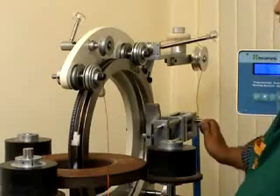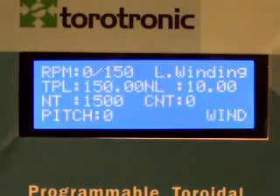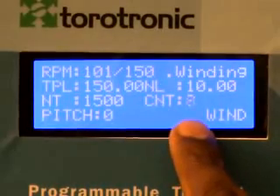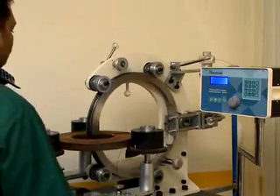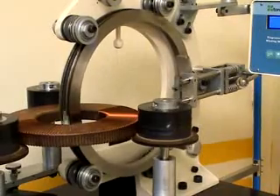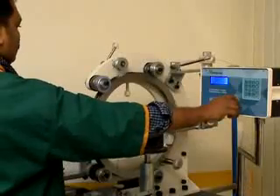Now apply a brake to the magazine. To start winding, press the white button on the control panel. We can see the count incrementing. Speed of winding can be increased or decreased using the speed controls. When the count equals the number of turns, the winding stops. Release the brake after winding, cut the balance copper wire after the last turn, and then remove the other end.